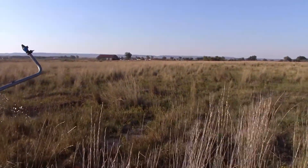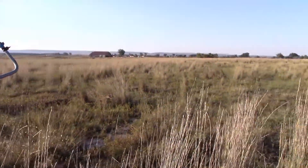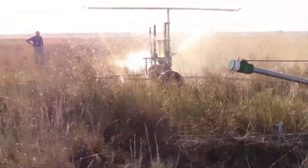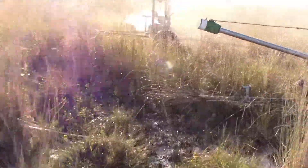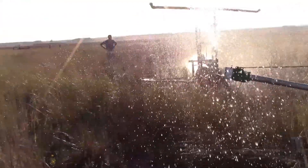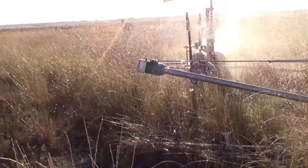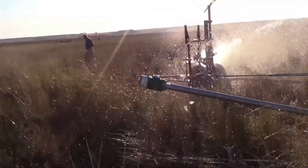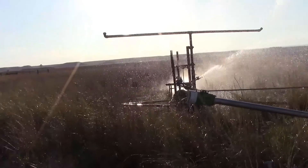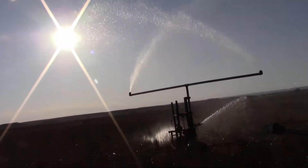See that hose going way out in the distance there. And that pressure will go up as soon as I put the other sprinkler on. I'm going to actually shrink these nozzles down here — I'm starting to think they might be excessive. They aren't very big — they're only a quarter inch up there. And I put two because I wanted a balanced load, because I was going faster turning up here. Same with the pipe up there too.